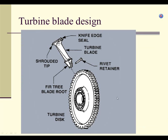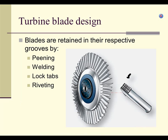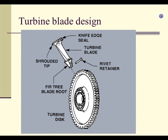Looking at this image: notice the tip of these blades — the tips are just open, nothing attached to them. Compare it to this other blade, which is installed with the fir tree root slid in and the rivet in place. But look at the blade itself — it's wide and has a flange on top. They call that a shrouded turbine.